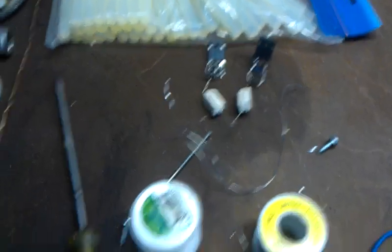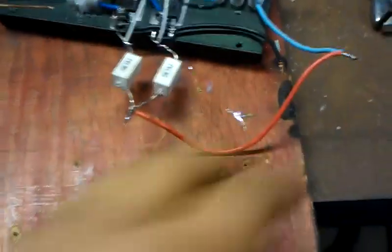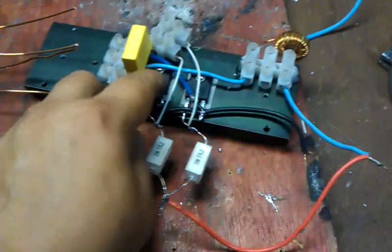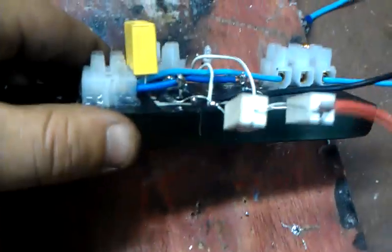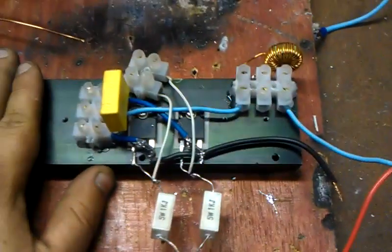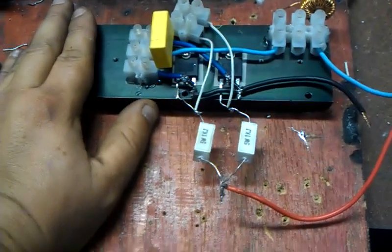Those Zeners and those resistors are probably still good — same with those — but not bothered. I have rebuilt a Royer oscillator to run on 60 volts. I've got the right size cable everywhere, so plenty of current can flow. I've insulated the core of this new flyback, wound some copper windings on it, 16 gauge. A bit of hot glue — hot glue everything down. It's all nice and neat. Everything is replaceable, except the transistors — they're kind of soldered in place. Half the fun in doing this is building the damn thing in the first place, so not too fussed.